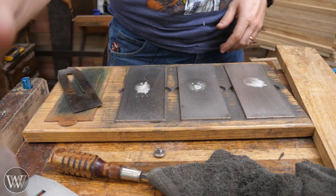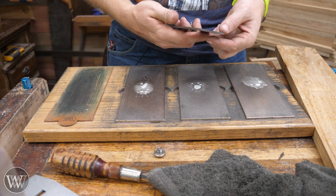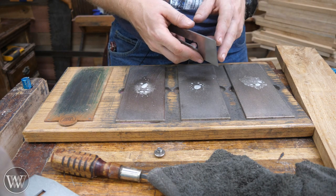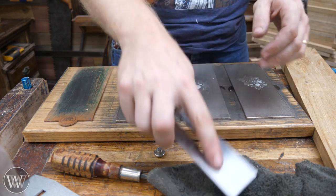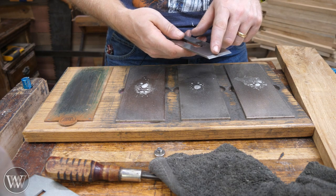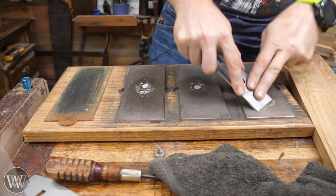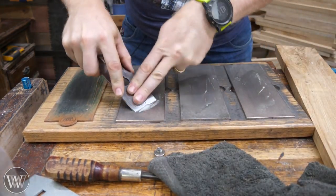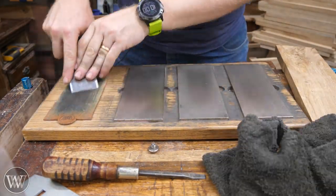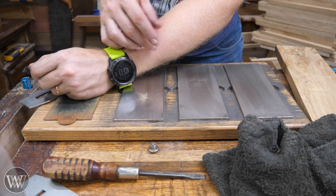Number one: we need to sharpen the iron. I have a whole pile of videos on how to sharpen irons and chisels, but we're just going to go through medium coarse, medium fine, and then onto the strop to get a nice clean edge. I'm going to do it all freehand at somewhere around a 30-degree angle — I don't want to go any more than 35 degrees. With a steeper angle the blade lasts a little longer, since this is a bevel-down plane. If it were a bevel-up plane you'd want a very high angle, but for this one, around 30 degrees. It's really less than a minute's worth of work. Clean up the back a little bit, take it over to the strop, and it's done. And yes, it does shave hair.